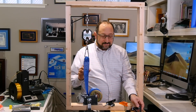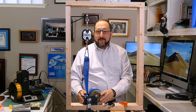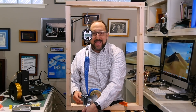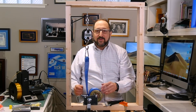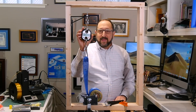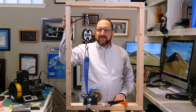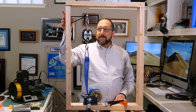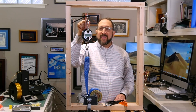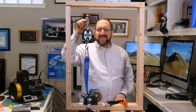Let's look at the test equipment. It's very simple — it's a box of 2x4s clamped to a workbench. On the bottom I have a winch, and the reason for a winch is I can crank it and get a very consistent amount of pressure. If I pull with my hand it's hard to do, but with a crank I can get a very consistent amount of pressure. I have a scale on here with a locking feature so it will lock at the lowest point. I have it attached to a shelf bracket that's attached to the side of this 2x4, as if it's a wall, in the same way you would attach it to a wall. We're going to put downward pressure on the end of this shelf bracket — in a practical sense the weight would be distributed across the whole surface, so we're testing a worst-case scenario.